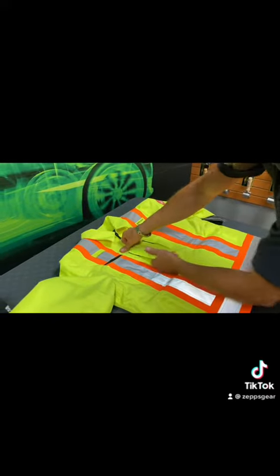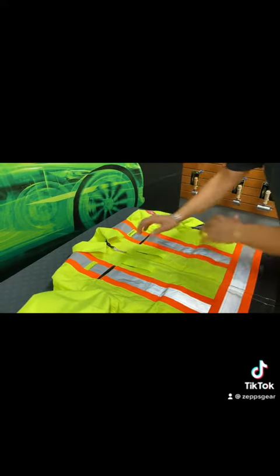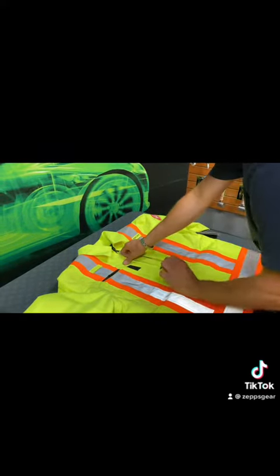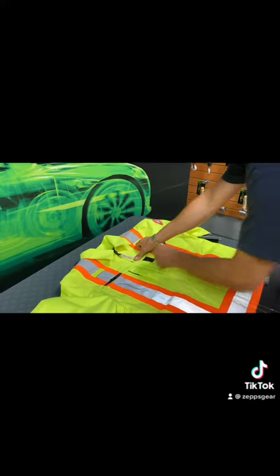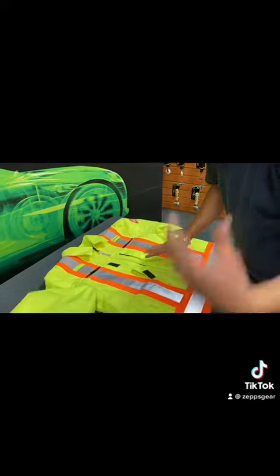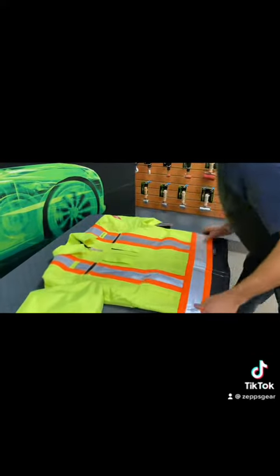This feature is for parking your lanyards. You want to park your lanyards here so they don't fall — when I pull here, you can see when you're walking around on the ground they're not going to fall out. But if you get snagged on something, there's a tear-away on both sides. If you get snagged, it drops — lanyard drops to the ground, not pulling you into any holes.